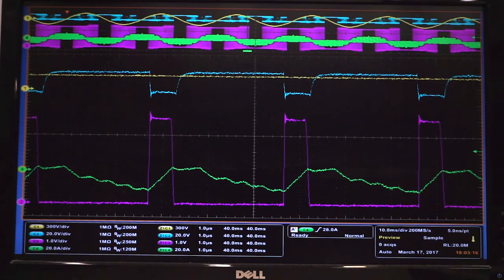Also, here is the zoomed waveform showing the switching cycle. We can see that the waveform is clean and ZVS is achieved. The efficiency at this point is 99%, which validates the high efficiency of the proposed modulation.